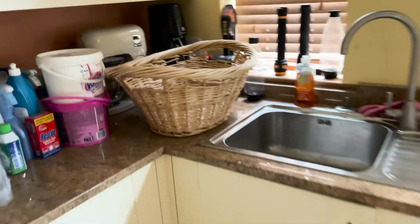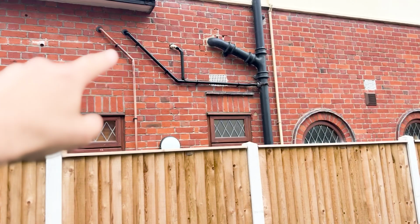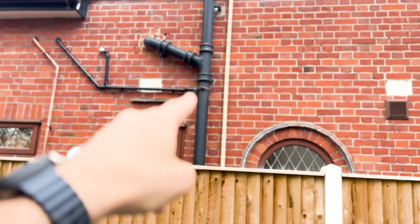In this kitchen here, under here, right at the back there, is the gas meter. So I come off that and run a new 28mm gas supply. You can see the gas pipe there. I brought a new 28mm supply out straight into this airing cupboard, and then this is the new condenser and PRV that comes out. I tucked it into that stack pipe.